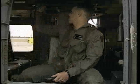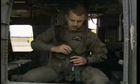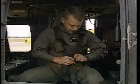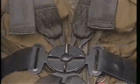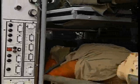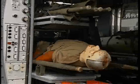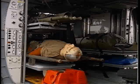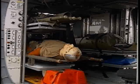The crew chief and gunner seats are located directly behind the pilot seats. Their seat belts are a 4-point single release system. The inertial reel allows crew member movement by extending and retracting. Releasing all belts and harness is done by depressing the release plate and rotating the knob in either direction. In the medical configuration, the UH-60 can transport up to 6 litter patients, or 6 to 9 ambulatory patients, or a combination depending on the model.